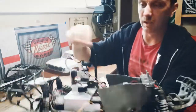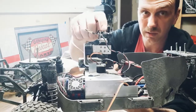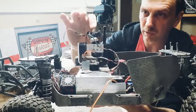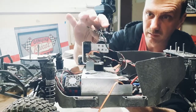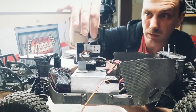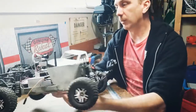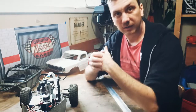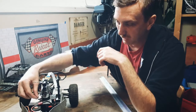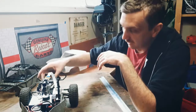Balance is important — for each motor the weight on one side has to equal the weight on the other side so it doesn't want to drift in a certain direction. If all the weight was on top it'd want to flop over. The gimbal motors are strong but not super strong, so if things are out of balance while going through bumps, jumps, or pulling g's on turns, your view gets thrown off. If it's minor the gimbal just recovers; if it's too much the gimbal can glitch out and needs to be reset.